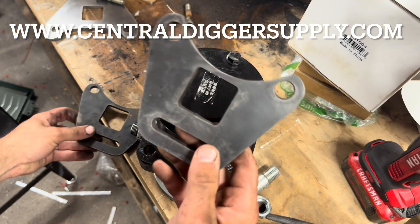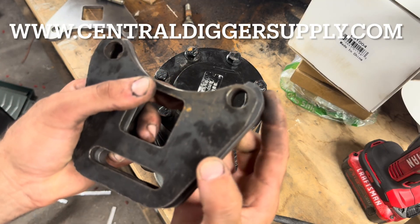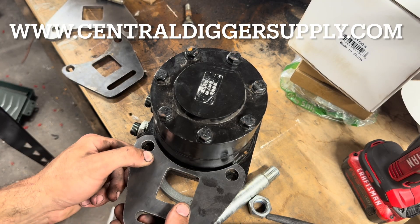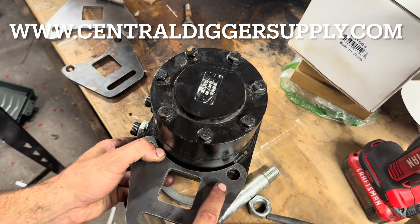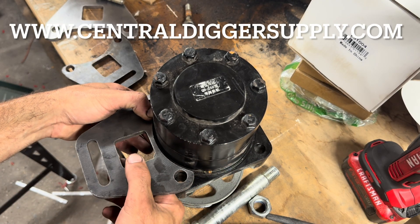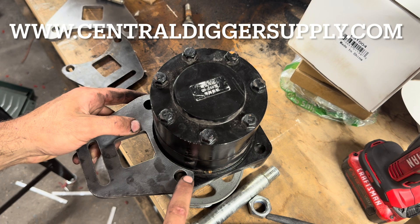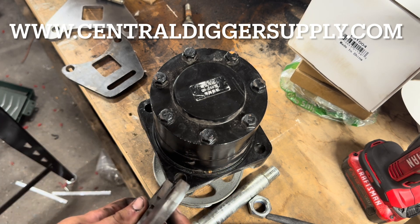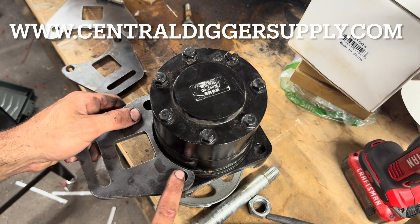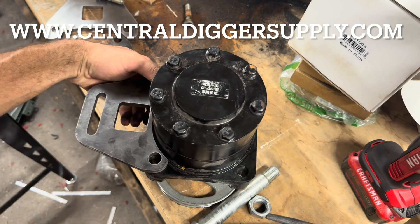I can't make this any bigger because then the holes won't line up. So for version two, I left some more material on this end. When you bolt this thing on — it fits better one way than the other — that's a good amount of steel right there. If you hit it from this direction, it's obviously not going anywhere. If you try to pull it the other way, the amount of force it's going to take to break off this whole thing — that's three-eighths plate — the force required to peel that open is going to be quite considerable.